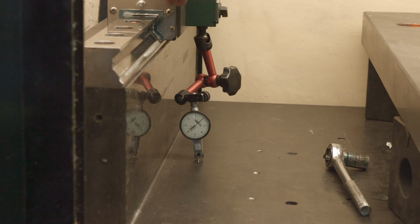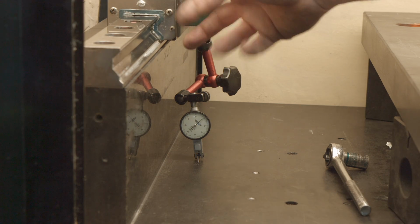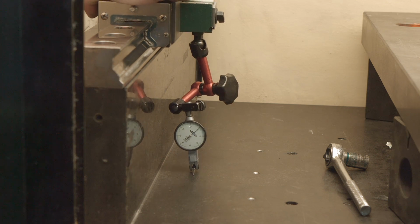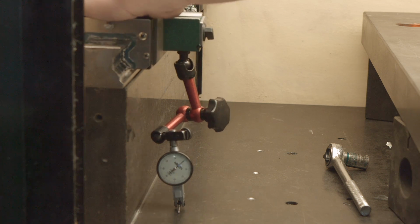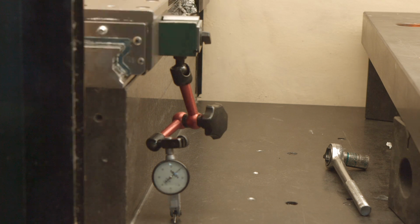The needle is jumping because the balls in the carriages are jumping on the plastic guide, so that's why it's a bit jumpy, but yeah, it doesn't go more than half. I'm gonna refocus that thing so you can see a bit better. So let me think now. I think I'm quite happy with it, you know, 5 microns, more than enough.